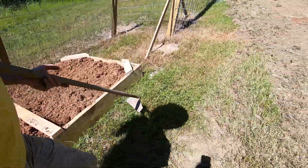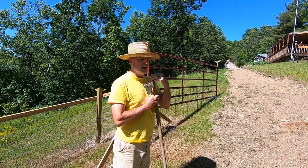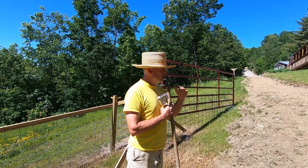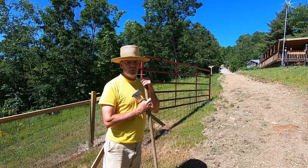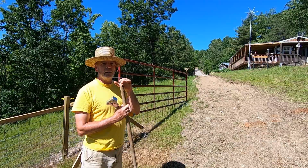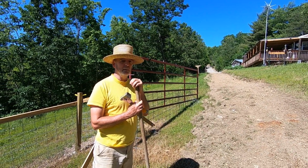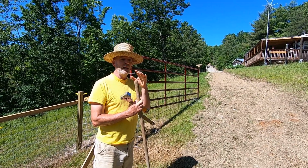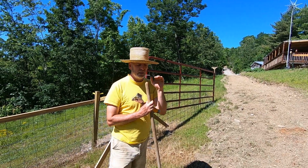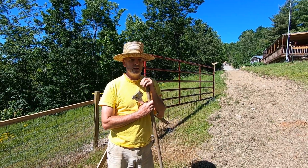And then I want to show you something else that we've done. I'm on a pretty bad hill here. I've got a gauge on the tractor for tilt, and just this spot here is at 20 degrees. At 25 degrees, you will start to tip your tractor. I know this, trust me. I about did it yesterday. I got real lucky. I've got beet juice in the tractor tires and it still wanted to flip. I had it raised too high. Keep the bucket low. I was trying to save some time, and saving time, of course, will hurt you.